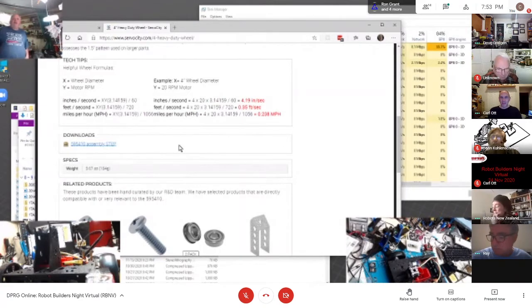Oh, that's cool. I was looking at what I was going to put on that screen because I got that. It's an ncurses based GUI. It's running on top of C# and .NET 5.0. It's pretty cool. I got a lot of screen real estate there that I'd like to fill up with deep information, and I can certainly do that. And with the Teensy, I should have enough to be able to read all that stuff and run I2C in various places and read all that current and put it out. Yeah, that'd be interesting to know. So many options.